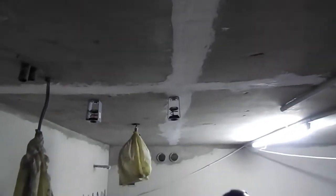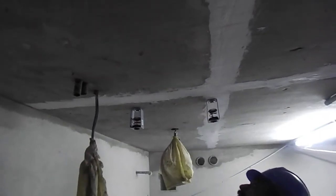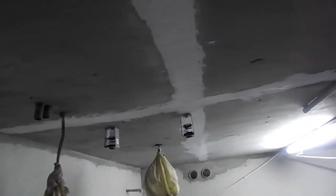This is aligning that one. As you can see, the isolators are being installed. You have to tighten the isolators firmly. After that, we need to adjust by hammer to make it straight. And one person is down checking the alignment for the isolator from this side, like this.